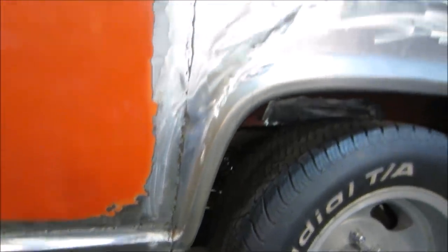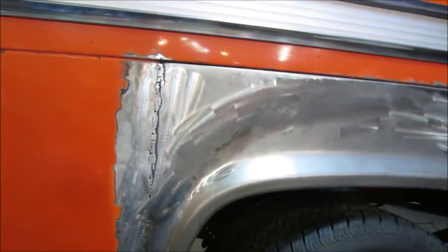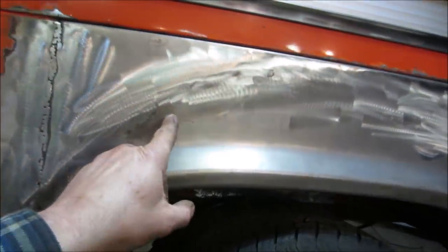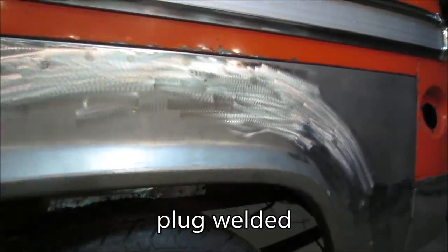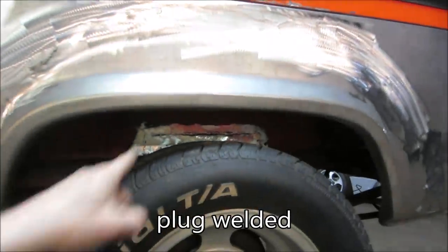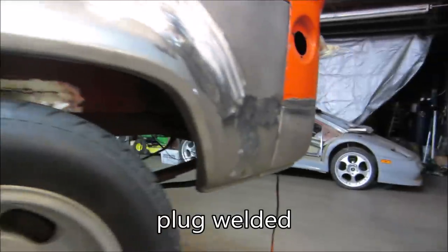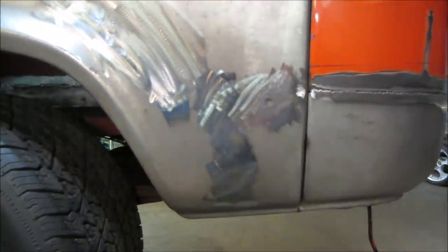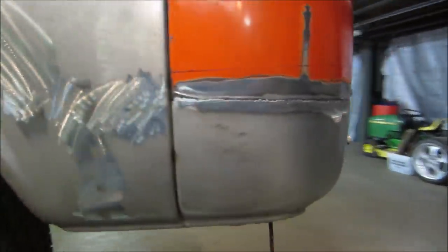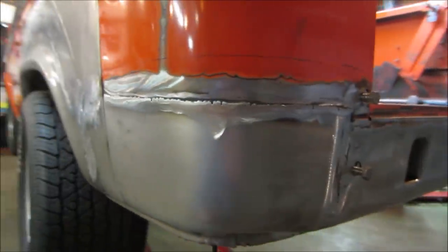There you get the quarter panel. That's all welded, and then it's spot welded for the wheel well, which is right here on the inside. So I spot welded it from the back. Got a patch in the wheel well. Same down here, there's a panel that drops across here and here. Those are spot welded from the back. Quarters welded in,